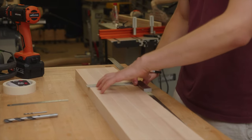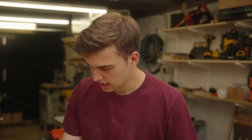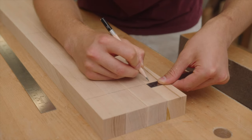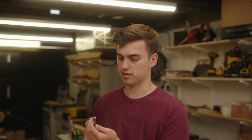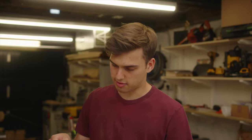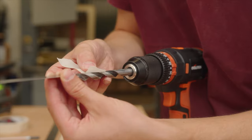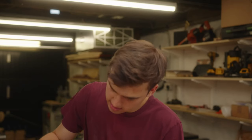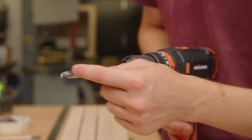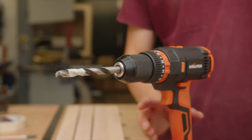Now those lines are drawn I'm going to be adding two screws in each leg for each shelf. If you use one screw then the shelf is likely to wobble, and each screw is going to be inset 11 millimetres from each edge. Now I've marked out all the screw holes it's time to drill the first hole, which is going to be the 10 millimetre one. I'm going to drill down 15 millimetres and I'm going to mark that with a bit of masking tape — using a ruler to mark down from the tip of the drill bit 15 millimetres. I'll wrap masking tape around the drill bit and leave a flap on the end, so as I'm drilling down that flap will turn and as it hits the piece of wood I'll know I'm at the right depth.